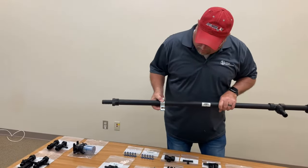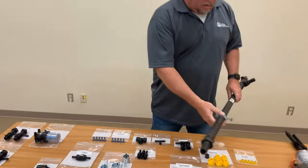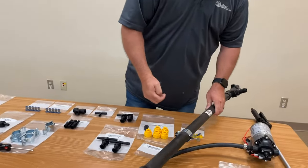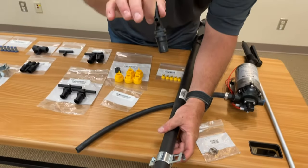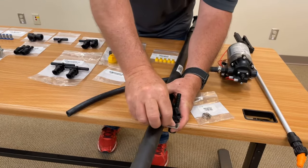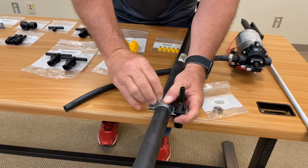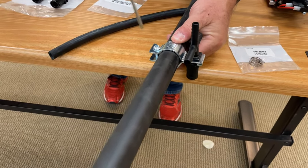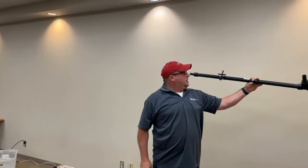As you can see, these have a little square cutout in them, and those are what the nozzle bodies slide into. There's a little square on the nozzle body, and you just simply screw the screw down until it's tight against the steel boom. And that is your structure for your nozzle body.